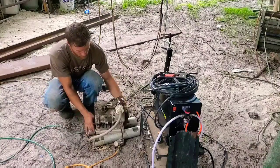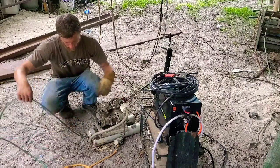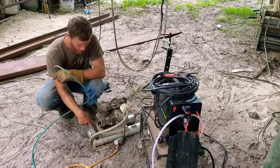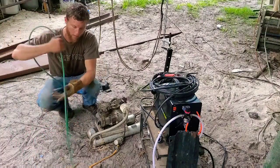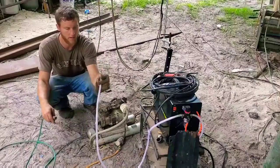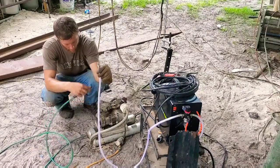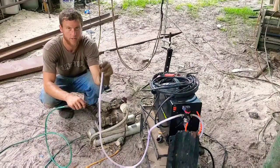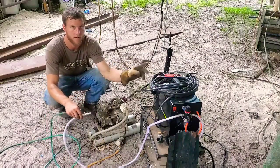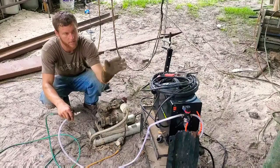It'll power up. What it does is it compresses the air inside these two little tanks, and then I put an output line on the second tank. So it goes into one tank, and then into the second tank, and then I put an output line. And on the output line I put a regular air fitting, like this — this is the fitting to my plasma cutter and this is the output from the little air compressor. When you plug it in, it immediately starts compressing air, and you can start cutting immediately. My gauge on the front of my plasma cutter goes up to 30 PSI the second it powers up. And this is what I've been looking for.